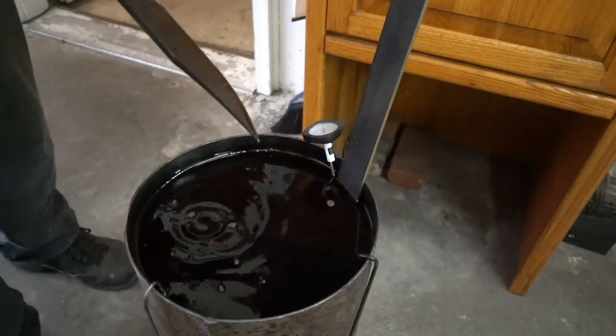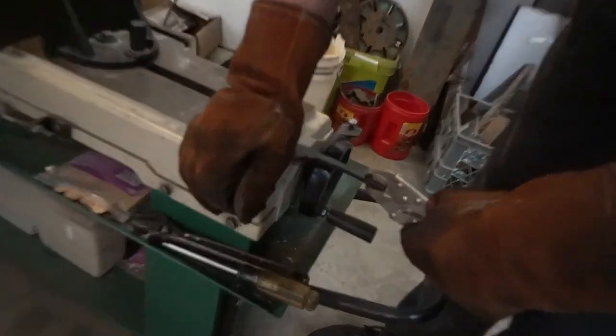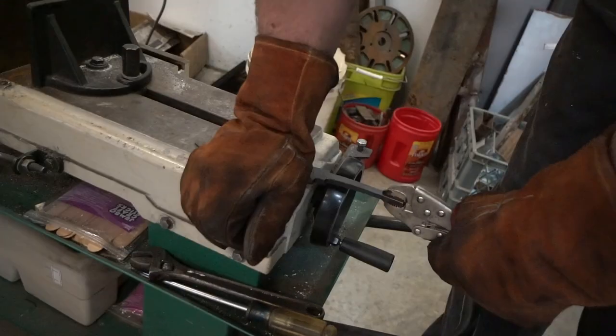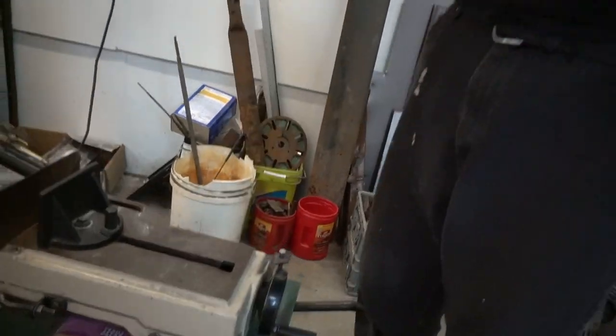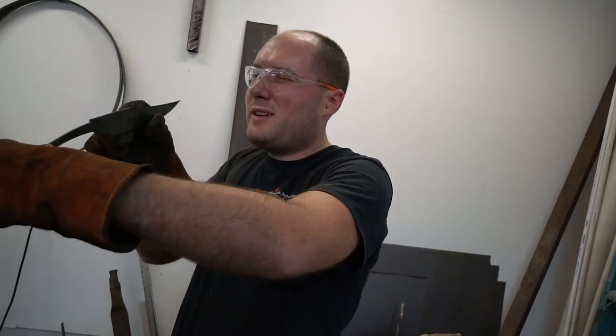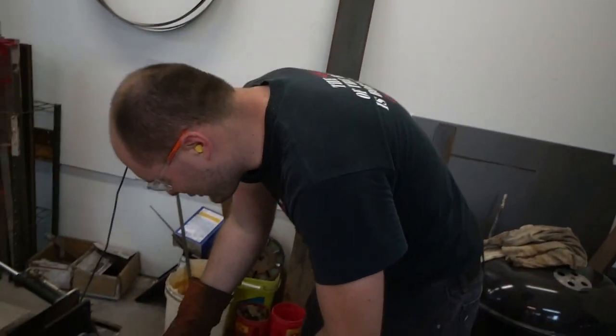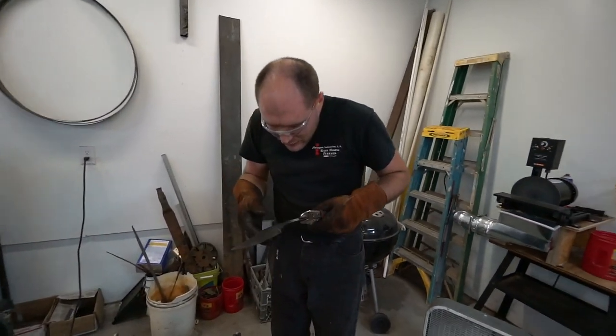It's got a bad warp in it. We've got to fix it, stat. Sometimes right after heat treating the blade is still influenceable. So if it warps, it can sometimes straighten it — although there's a chance I could break it too. Is it really that brittle? Hopefully it's brittle if it hardens. The tip is warped a little bit, I might have to grind it a little shorter. That's okay because that bad spot in the blade might make us do that anyway.